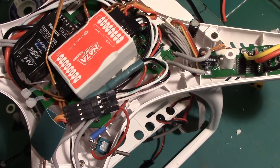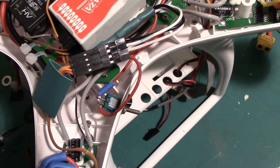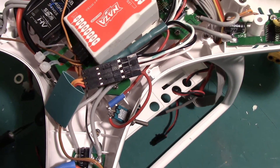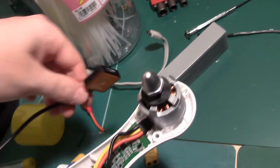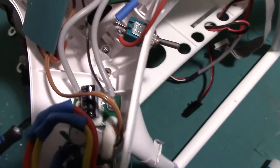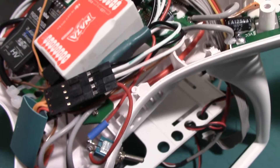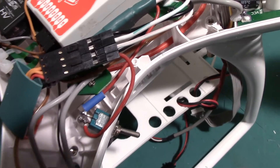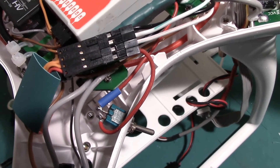Looking at the guts of the Phantom to combat the problem — basically when you plug the USB plug in, it's obviously stealing power, causing problems and not connecting. What I've done with this dual LED setup, with the stock LED at the front and the V2 LED at the back, is I've wired a very light 3g switch into the VCC that goes to the LED board. I tried the ground wire to begin with but that didn't work — it caused a USB error. But by wiring a switch into the positive, the VCC, that seems to solve the problem.